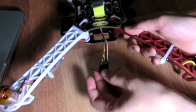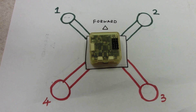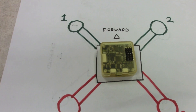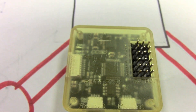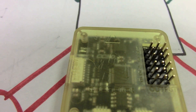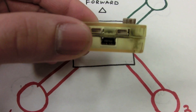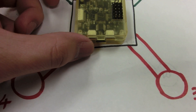If you purchase the copter from us, the flight controller is already installed and the ESC wires are already connected. But let me show you how you can install the flight controller on your frame. The arrow on the top of the case indicates the forward part of the flight controller. If it's not in the case, the USB port should face backwards — that mini USB port is the back of your flight controller.